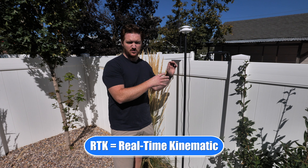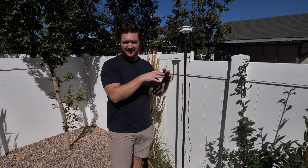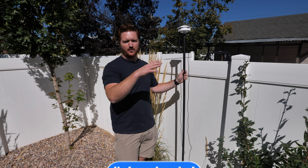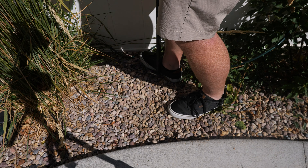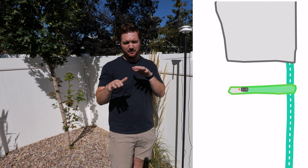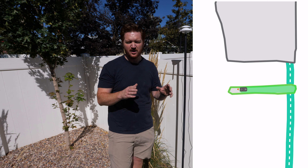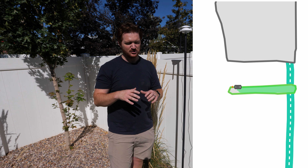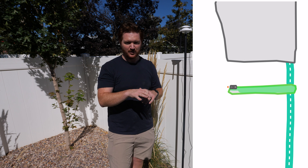First, let's talk about how this is going to be navigating around your home. Here we have an RTK station with GPS location so it can tell the robot where it is on your lawn. It just needs to be placed away from a home or any tall trees. Now it's going to use the RTK with the V-Slam that's built into the robot — using the RTK to position it and the V-Slam for additional positioning so they're overlapping. If the RTK signal happens to be weak, the robot can still navigate with V-Slam, and as RTK gets stronger it will have double coverage so it knows exactly where it is on your lawn.